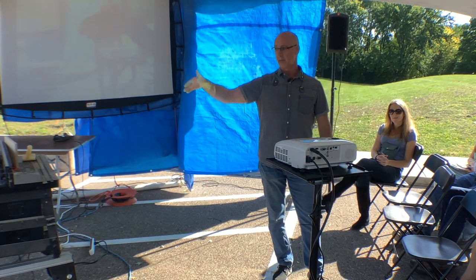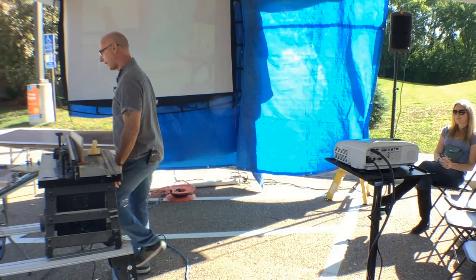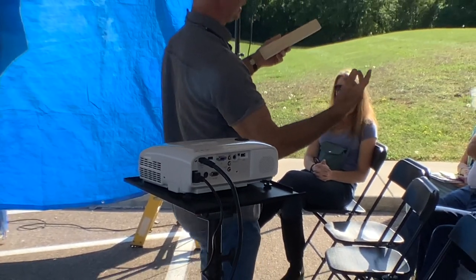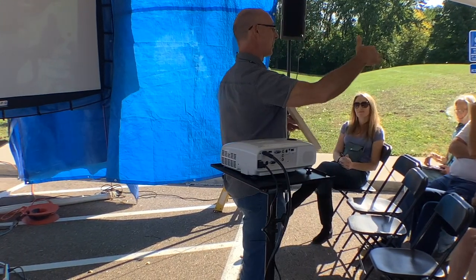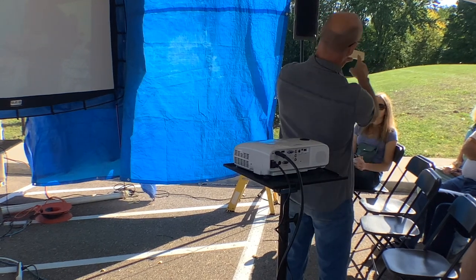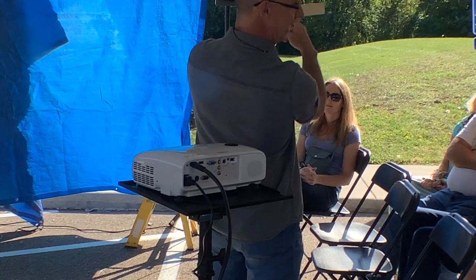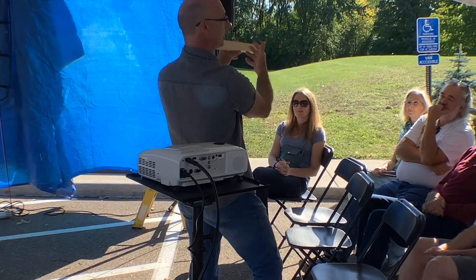The other thing shapers offer is the ability to reverse the spindle. What's cool with that is, commonly in wood, when we're cutting, you want to read the grain and cut it in the direction that it wants to be cut. The analogy I often use is, when you pet a cat, and I don't know why you would, but if you chose to pet a cat, when you pet it from head to tail, the cat likes that because the hair is laying down. So this piece of wood is your cat, and the grain is doing this. This cat wants to get petted in this direction. And if I pet it in this direction, just like on a cat, the hairs, which are fibers in the wood, stand up and can sometimes chip off if it's a gnarly piece of wood, if it's bird's eye maple or flame birch or something like that.